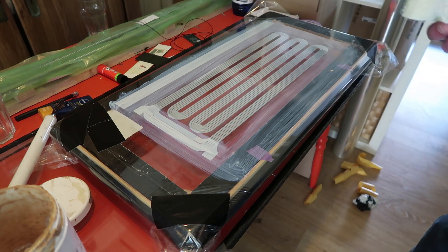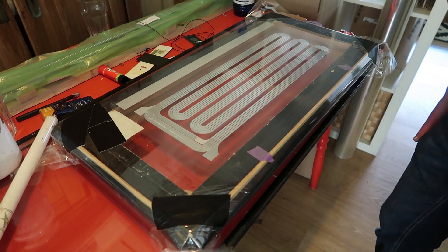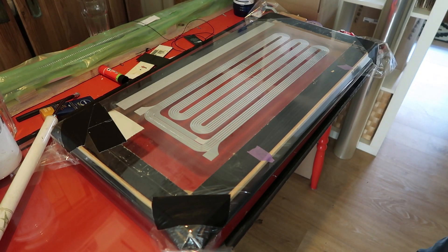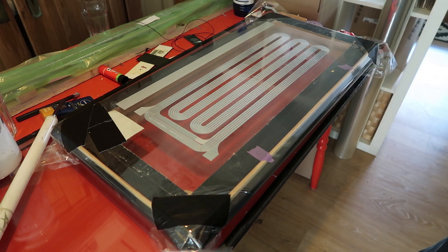There's no room to lay it down. So, be right back, and in the meanwhile this will dry. Glue is dried. Glue on the panel has dried. One thing to note is that I used cyanoacrylate yesterday as a sealer of the MDF. But it creates such a high surface tension on the material that the glue will bead up — like drops.